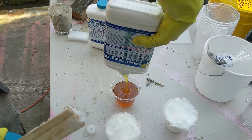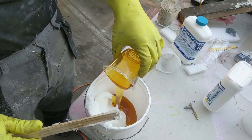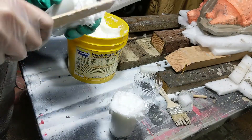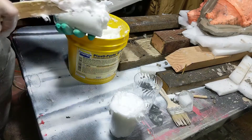No matter what kind of paste you're using, it's not good for you. Be sure you're working in a well-ventilated environment, have proper clothing protection and proper gloves. This stuff isn't fun to breathe in, so have a fan or at least a respirator. The paste needs to be mixed at a ratio of 2 to 1. It's best to put everything in equal cups, then combine them into one big mixing container. When measuring out Part A, you'll find out pretty soon that it's thicker than Dexter's mom from Dexter's Laboratory. The fibers that are pre-mixed in make it difficult to stir, so make sure you have a durable mixing container. When dispensing it into cups, make sure you pat down as much as you can, or at the very least leave a little bit on top to compensate for any air gaps. Be sure to use a thick wooden mixing stick — tongue depressors break too easily.